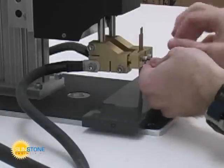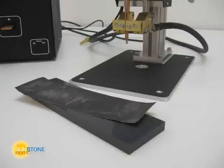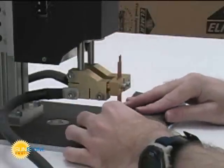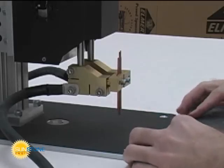It is helpful to resurface the electrodes to ensure the surfaces are even and smooth. Use a fine grit sandpaper of around 600. Use the stop nut to ensure only light pressure is applied to the electrodes. Pull the sandpaper gently outward while the electrodes are depressed onto a flat hard surface.